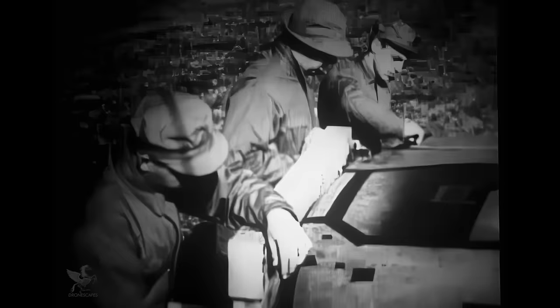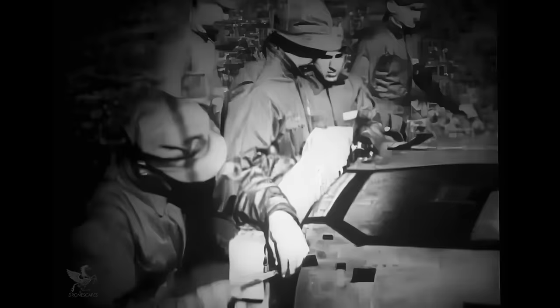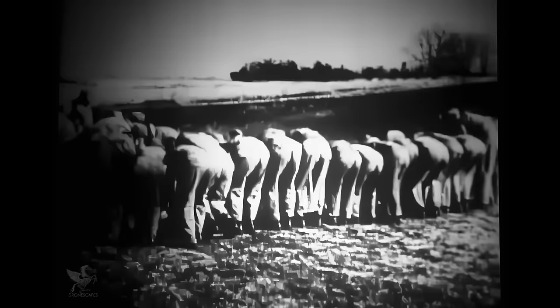When its top has been pulled off, the sides and ends of the wing case are removed by the same methods used on the fuselage case. After the hinge fittings in the wing case have been loosened, approximately 50 men, using the fuselage side stringer sections for lifting, carry the wings out of the case and place them on the ground. This wing is being turned over so that the landing gear is on the underside for convenience later on in assembly.